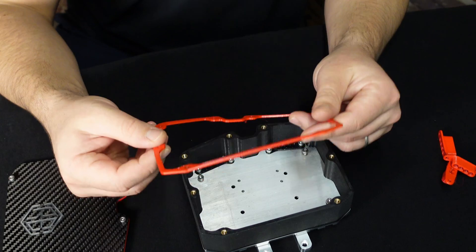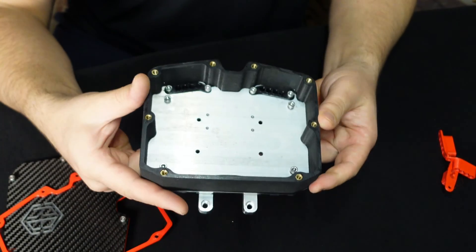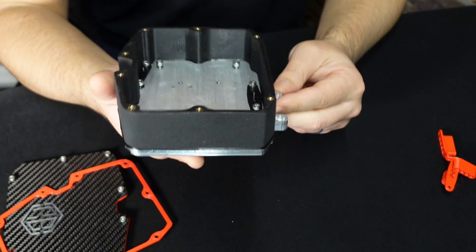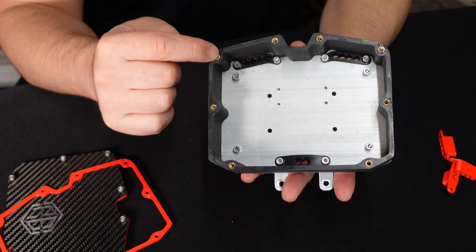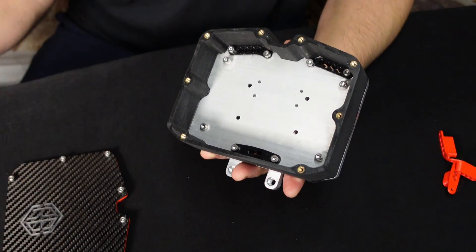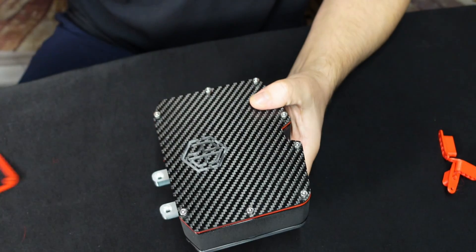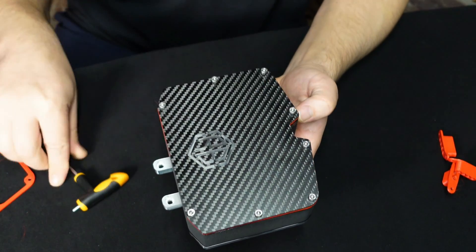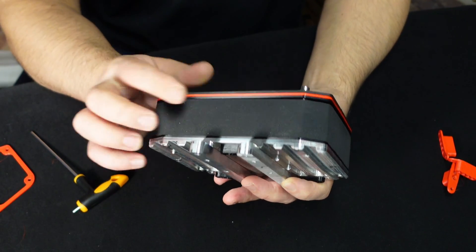This box is not 100% waterproof, but the only reason is these gaskets where the cables go through. It's definitely splash-proof — you can probably even wash it down from the top. As long as you don't flood this box, the water will not get in. The threads inside the 3D printed part are brass inserts, positioned really nicely and correctly. As soon as the cover goes on, you can catch every single screw all the way around, and there are plenty of screws to give nice equal pressure to tighten up the cover and squeeze the gasket.